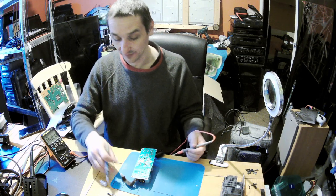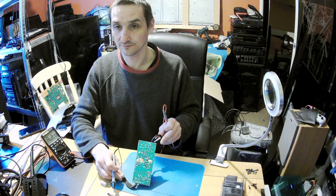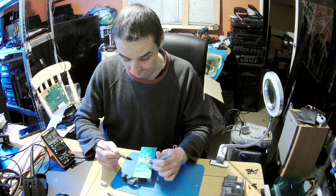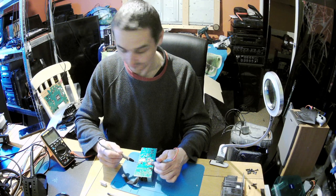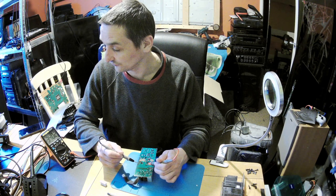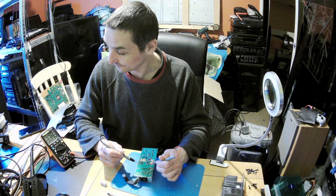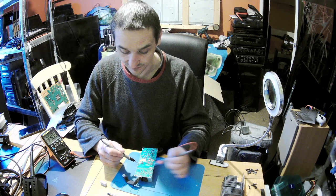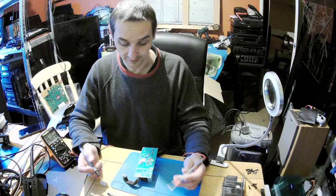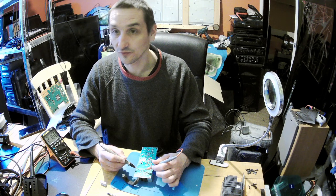And let's get the transformer, which is here, this clear zone. Is a transformer. Okay, this clear zone here. So let's check this pin and this pin. We've got 340 volts DC, for those who don't know it. 340 pretty much. It's working till the first primary, the hot section, you can call it. And then behind it, it's 2 volts.